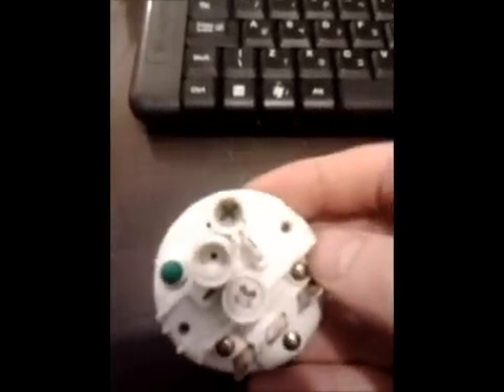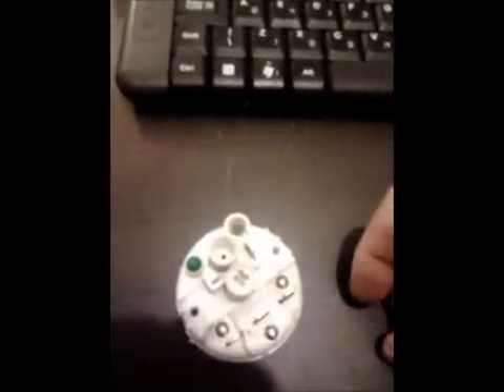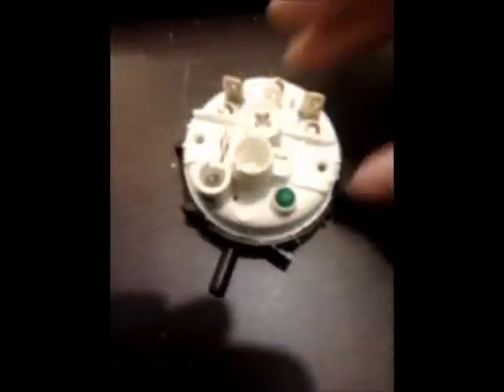I played a little with the screws here and managed to short circuit it and couldn't understand what was wrong, so I thought maybe I would buy a new pressure switch. But before that I decided to try and see what is going on inside from the other side of this switch. It was inside this black plastic — I took a tester screwdriver and pried it out. This is the entrance of the air where the pressure of the air rises and then it changes the state of the switch.